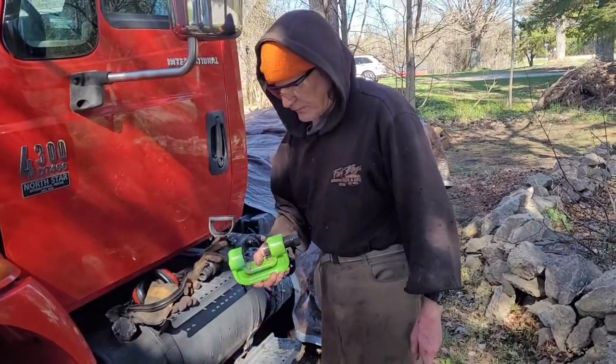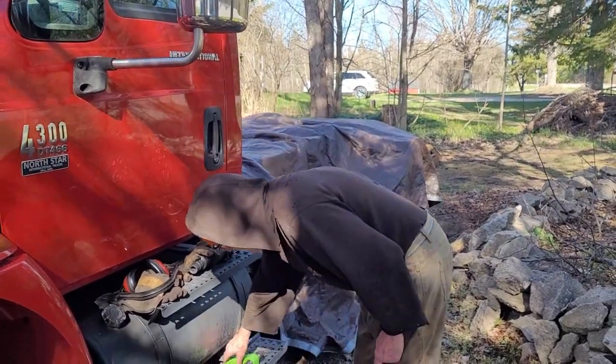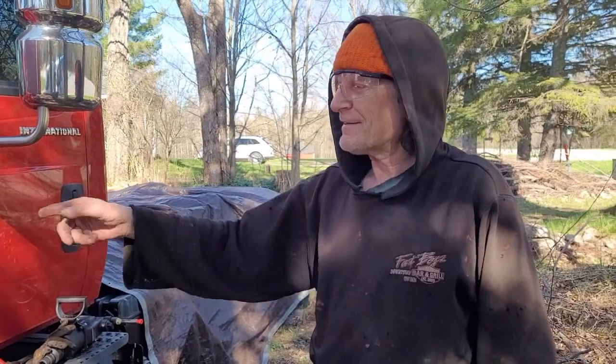This is the pin press. You can't put the pin press on first and then heat it up. I did that on one over there, and it just took so much, the pin press sucks so much of the heat off, your pins never get hot enough.